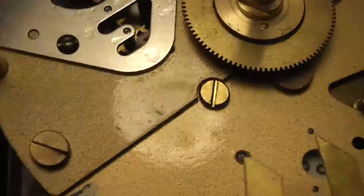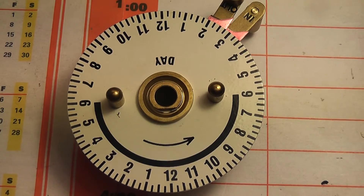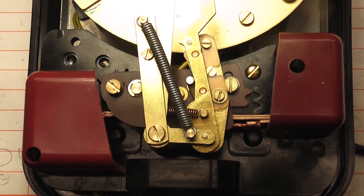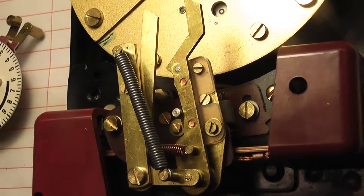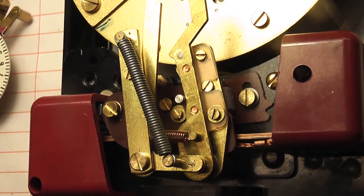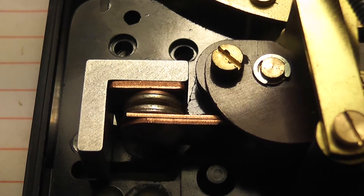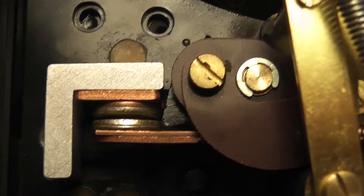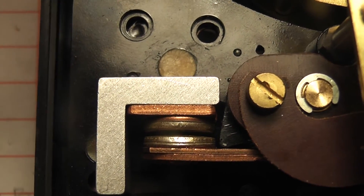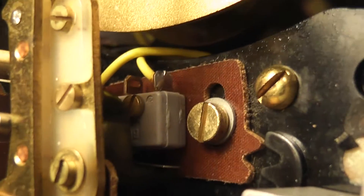It's always interesting to note that English clocks seem to have a left-hand rotation, whether for the winding arbor or for the actual 24-hour dial, in comparison with European clocks which turn normally clockwise. The contacts are very well made: the main contact is 80 Ampere resistive, with a 2-Amp contact adjacent to it. There's not much of a gap between them, and there's a 2-Amp micro switch sitting there as well.